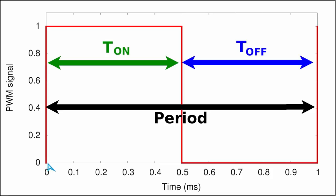If we connect an oscilloscope to the output pin of a PWM controller chip, we would see a signal where when it goes HIGH, the chip tells the switching element — most of the time a field effect transistor — to turn ON. After a while the PWM controller chip tells the FET to turn OFF, so the signal goes LOW and for an amount of time the switching element will be turned OFF. After a while this whole process repeats since this is a periodic function.